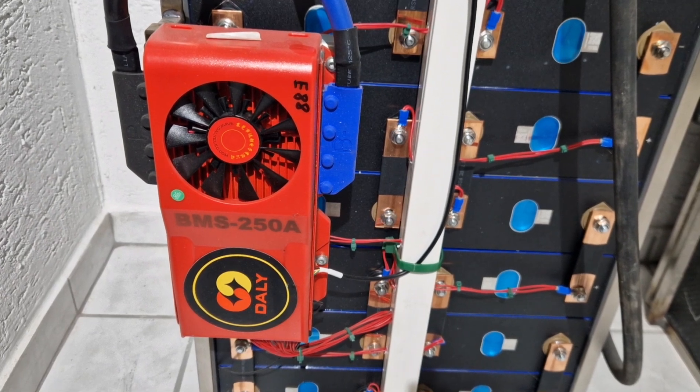I've reinstalled a 250-ampere BMS with a fan. One might ask why such a large BMS is needed — 180 amps or any available amount might suffice. But one must be cautious: in the unlikely scenario that one of my three inverters fails, 15,000 watts can be drawn, which would be about 375 amps. The BMS can withstand that briefly without issues. Previously with just a single battery, the voltage would have dipped so low it would have powered off. Now I have both batteries connected to the bus bar, so the entire load is halved and I'm comfortably under 200 amps.